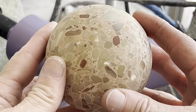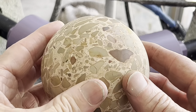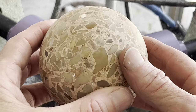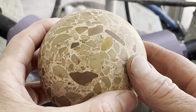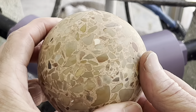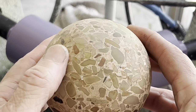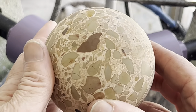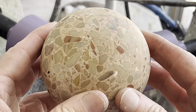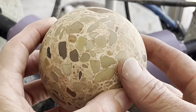Here's how it looks after the 400 grit — I think most of the scratches are gone. You can also see a little bit of color in there, though I think the reason it looks this colorful now is because the rag I wiped it down with might have had a little mineral oil in it, so it shouldn't look this dark at 400 grit. Anyway, the next grit is 1200, which should look much better. At this point you want to look for any big scratches, because the next two I have are 1200 and 4000, and they will not remove deep scratches.